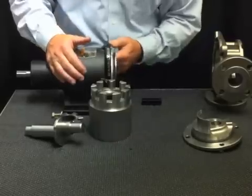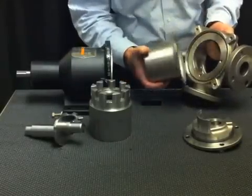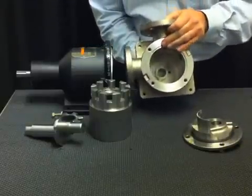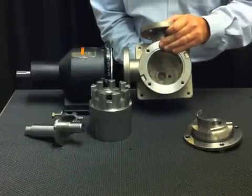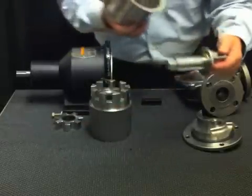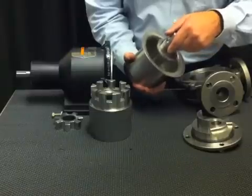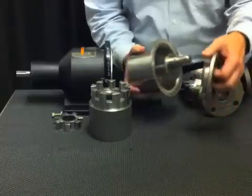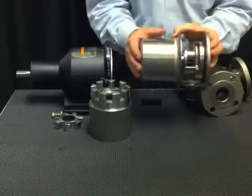You can see that by looking at the containment can, where the rotor assembly rides — it seals up against an O-ring on the casing. When the pump is bolted together, the flange of that containment can seals against that O-ring, and looking through the front of the casing you can see there is no restriction of flow between the casing and the containment can — therefore more flow, more cooling, a far simpler design. Back inside the containment can is the rear support for the spindle. The spindle is then also supported at the crescent and in the head. When fully assembled, we have two points of support for the rotor gear and two points of support for the idler gear.